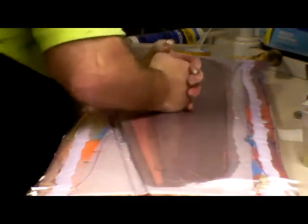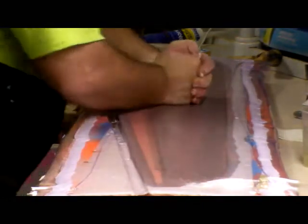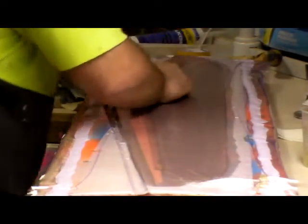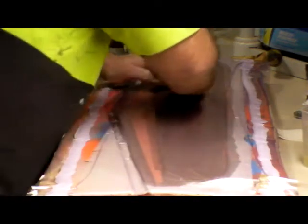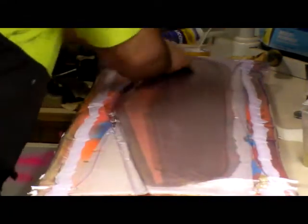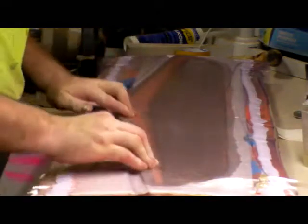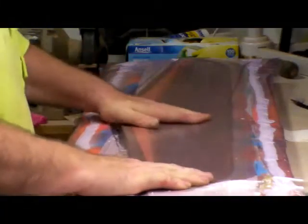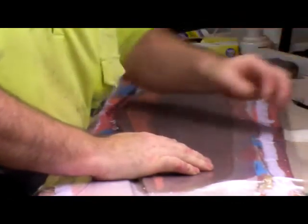What I'd like to do next is just make sure everything's well pushed down and there's no air trapped underneath that skin. That's it. The other side is exactly the same without the Kevlar. The other side is all sucked down and looking good, the pump's not cycling. So it's time to call it a night. These have been sucked down overnight and all day, so I'm just going to take them out now. Just turn the vacuum pump off.